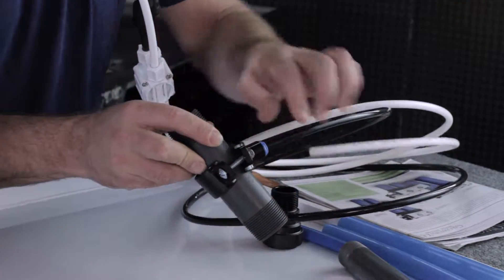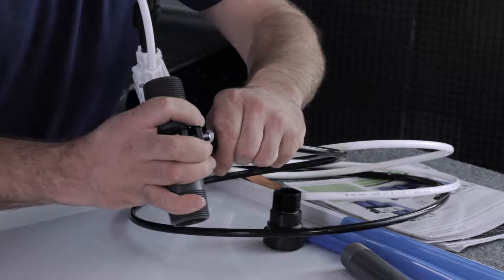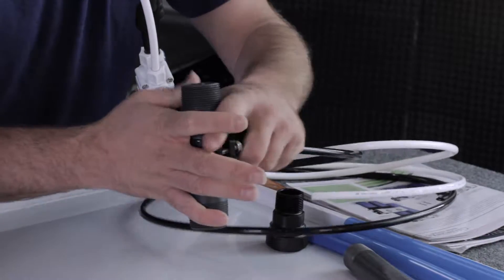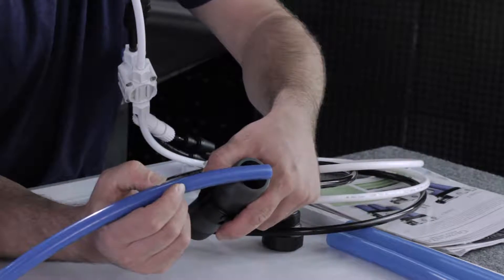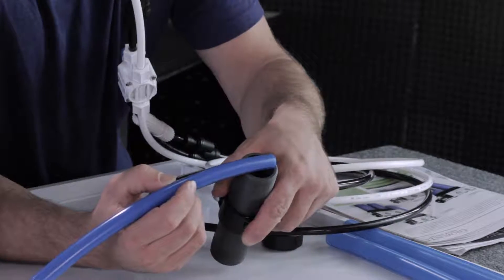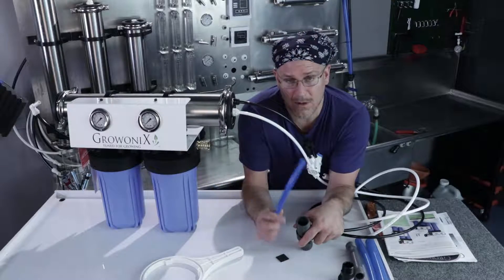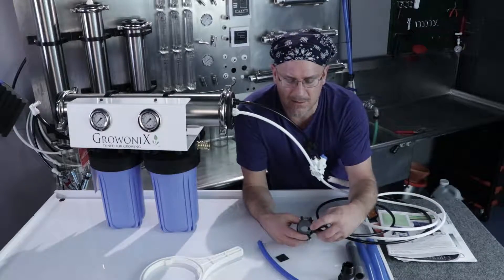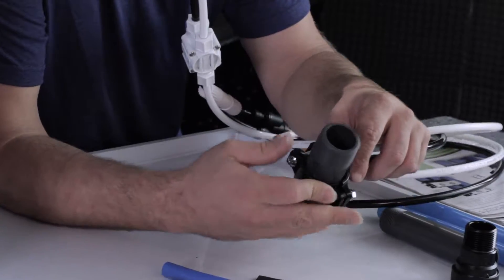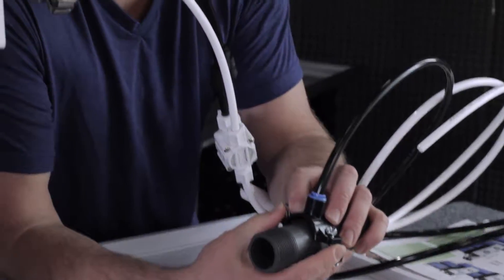Put the pipe over it, line up the tubing with the hole, and push it a little further. You only want it to go about halfway into the pipe. If you push it too far, the tubing will be butted up against the opposite side and could restrict drain flow. Restricting the drain flow at all will throw off the system ratio. Make sure the tube goes only about halfway through the pipe, then clamp down the bolts on the drain clamp and you're good to go — secure and leak-free.